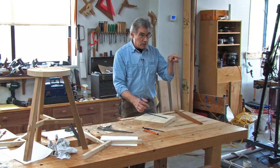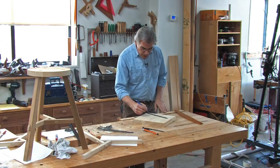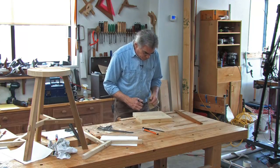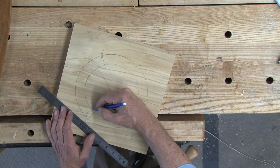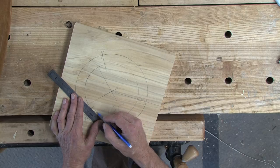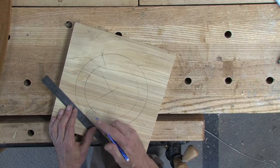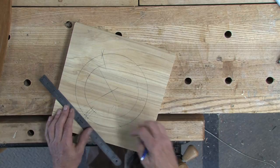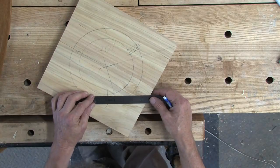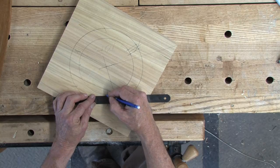When we're going to do this, we're going to drill these out on the drill press in a similar way that we did the other ones. And I'm going to want to line up the center line for the drilling. Now, in theory, this end is a real slight arc, and I'm going to want that to be a straight line. And this probably isn't necessary, but there is a significant portion of people in this class who that would bother. So just so you guys can sleep at night.